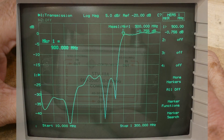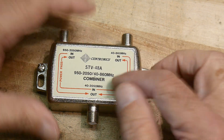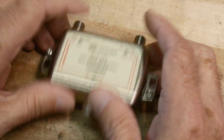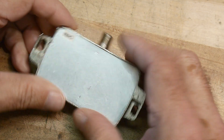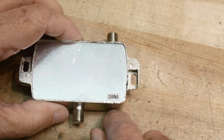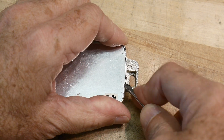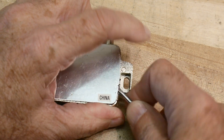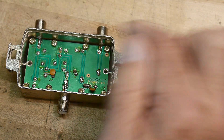So I thought what we'd do today is we'd open it up and see how these things are designed inside, and see how they do the duplexing. These are 75 ohm F connectors, made in China. I've already got a little hole over here on the side, so I can get a lip of a screwdriver under here to take the bottom off. It's not soldered on, it's just pressed in there.